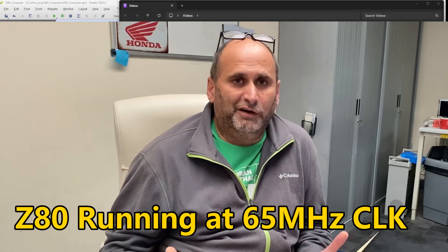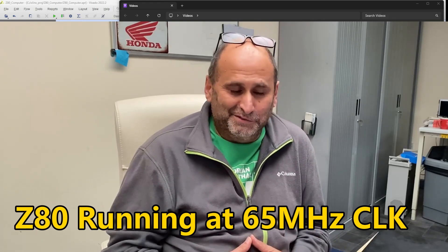An interesting fact is that I'm running the Z80 at 65 MHz. You may wonder why 65 MHz — that's actually the pixel clock for the video side at 1024x768 at 60 Hz, so I decided to run everything off one clock. I made some experiments and I can probably run the Z80 at 80 to 85 MHz. So I have a Sinclair Spectrum running at 65 MHz, which is not exactly practical because it's way too fast, but it works and I'll show you how.